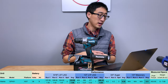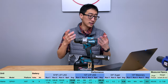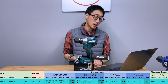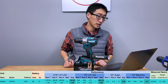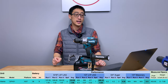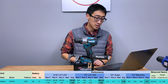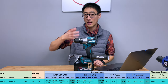We did not run the masonry test — we forgot, and there's probably not going to be any difference anyway. We don't factor it into the leaderboard ranking, so it really doesn't matter. The peak torque measured across all tests with this drill and battery combination is 453 inch pounds of peak torque — that's a lot for a small handheld drill driver. This tool and battery combination with the handle weighs in at a whopping 8 pounds 7.68 ounces. That is a heavy drill — probably the heaviest battery-powered drill combination we've tested on this channel.